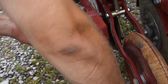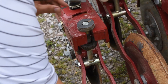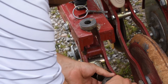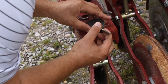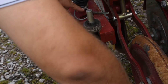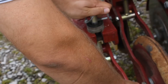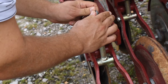To adjust the press wheel height, remove the quick attachment pin. To lower the press wheel, relocate the shim washers from the top to the bottom. Seeding depth for many grass species such as fescue and ryegrass is about half an inch. For other species such as cool season small grains like cereal rye, wheat, and oats, the planting depth recommendation is about an inch and a half.